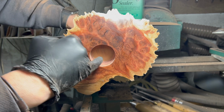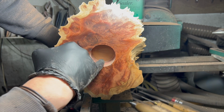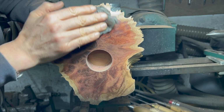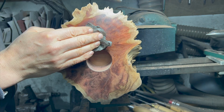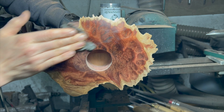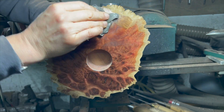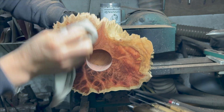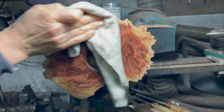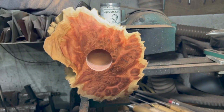I'll do the inside by hand a little bit later because I can only get halfway down. I have run the sandpaper in there and it's nice and smooth. Pretty. 3000 grit finish. Concentrate on the 600. Quick over with 1000. Quick over with 3000. Just get rid of any minute little lines. And just putting some microcrystalline wax on now. Renaissance. Give it a quick wipe off. That'll do. Column next, I think.